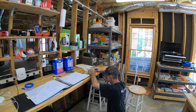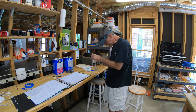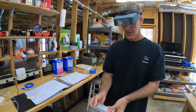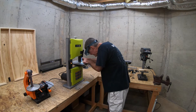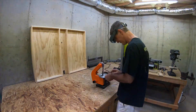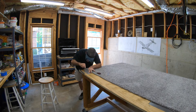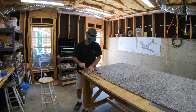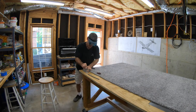Here I'm carefully measuring and marking on the other side of the angle stock so I can make what will be the top part of the brackets. I'm going to cut this off all the way along the length of the five inch piece. The only tricky thing about the measuring and marking is that you have to measure and mark on the back side, then transfer that mark around to the front side so you can lay it flat on the saw and make the cut. Then it's just filing, filing, filing - measuring and filing, working my way down, cleaning up the edge and also working off enough material so it's exactly the right dimension.